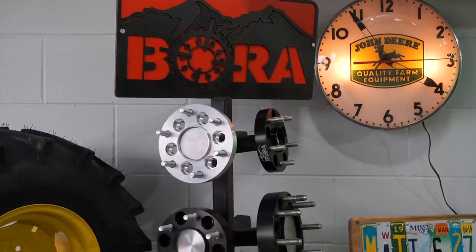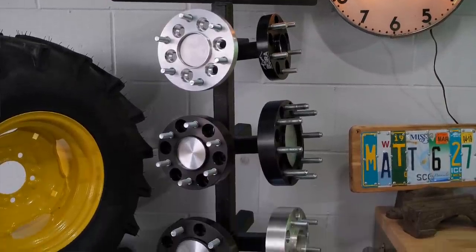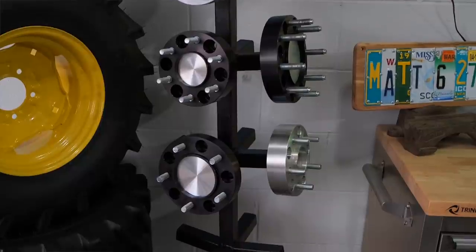These are two inches wide. You don't necessarily need to go six-inch wide spacers on either side - it's going to be dependent on your machine and your situation. There's going to be aluminum and steel as well, but if you're running a mid-mount mower, you're going to have certain limitations on most mower decks with how wide you can go. Two-inch spacers today - it's going to make a big difference, adding roughly 10% to the overall width of the tractor. If you want to see what wheel spacers look like installed on your tractor and how to do it, stick around because I'm going to do this for the first time, so it'll be a little bit of a learn as you go.